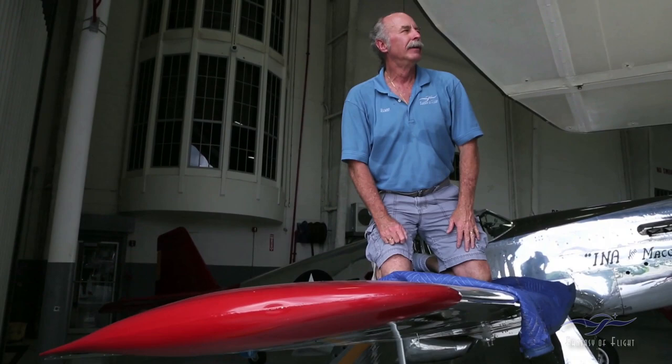I'll have to go back and look at that, but I knew there was a crosswind. This thing's notorious in a crosswind because it's got so much dihedral, it lifts a wing if it gets too slow. And I think in the end it was almost a three-point landing, but by that time, man, I was hard on the rudder because it was wanting to swing into the wind. And anyway, keeping the ailerons down. Everything worked out good and everything's safe, but obviously we've got an airplane to rebuild. Over and out.